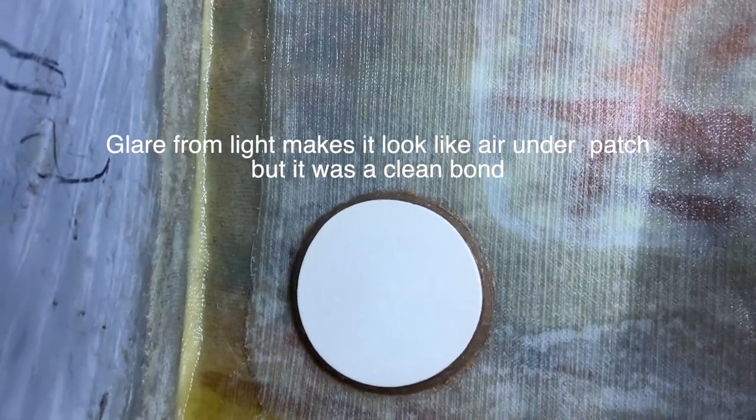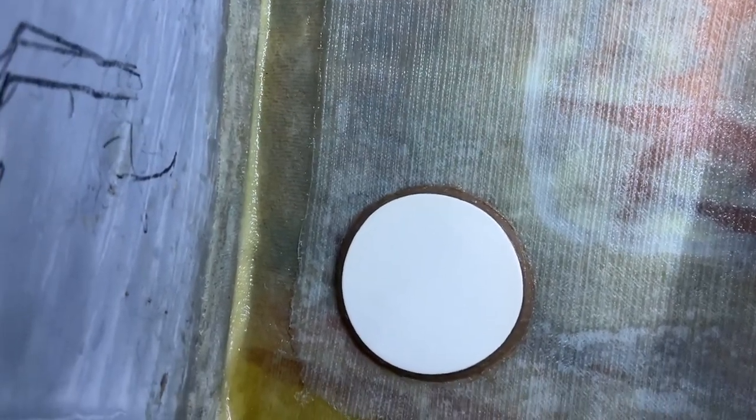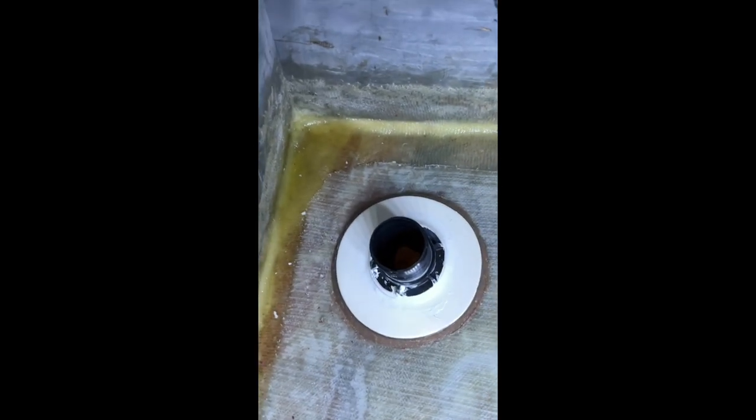Tomorrow, after that's cured, I'll drill my two-inch hole again from the bottom side — from outside — and clean it up again, then put in my transducer. You can see where I just broke a stick and wedged it in place. Then I go inside and put the washer nut on. Made a little bit of a mess with the 5200 — I always seem to get it everywhere. I got it a little too far up the threads and it smeared, but it's alright — it's all bedded good. Once it cures I'll put the transducer in. I've got a weep hole right down there.